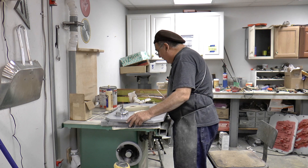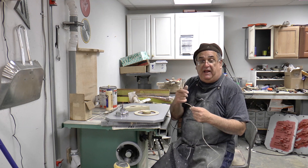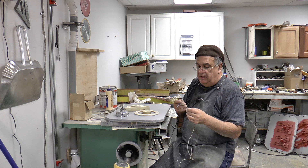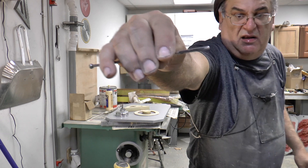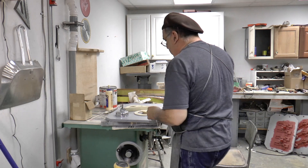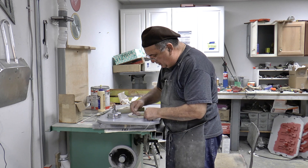That is an alcohol lamp - you probably can't see the flame. We've got the wax. This is the wax, it's round. The other wax I have - the next size is two, I got three different sizes, up to eight: three thirty-second, one-eighth, one-sixteenth. The difference is this one's rounded, and those are radius-shaped like they're supposed to be. What I have to do with this one is first mash it down with the round ball to get it flat, and then go around with the smaller ends. Just heat this up.